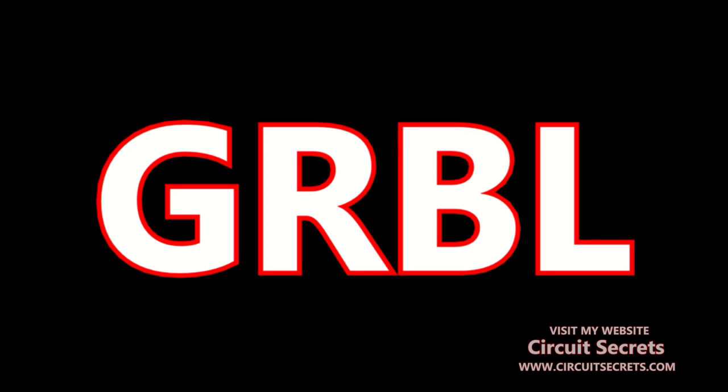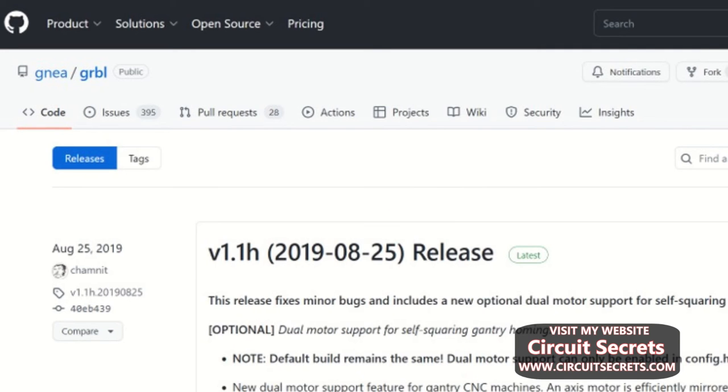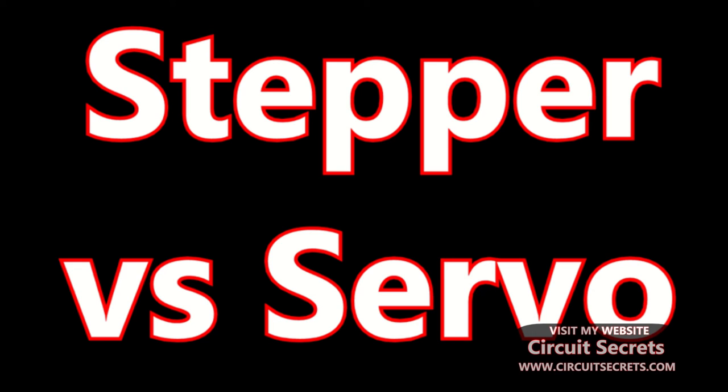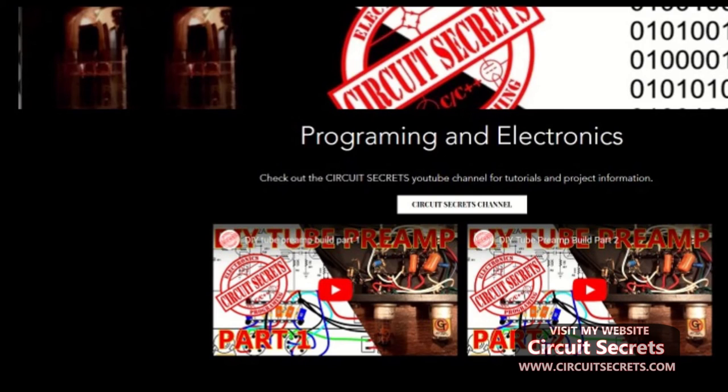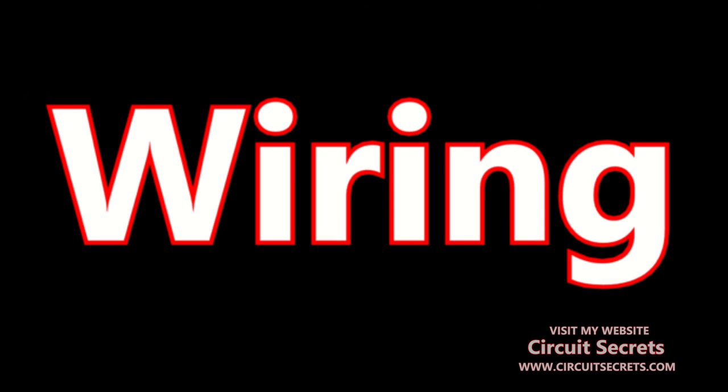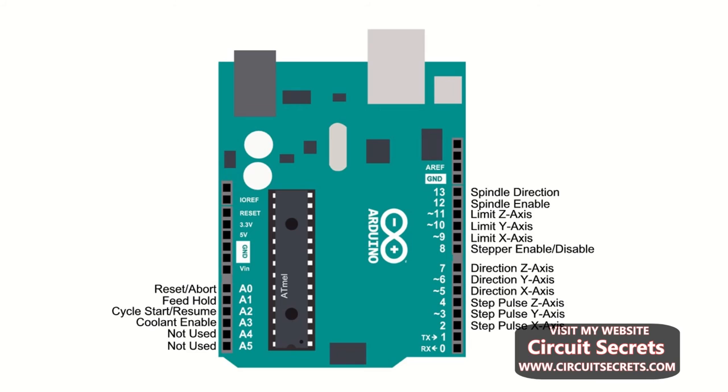On my rig I used an external homemade serial port adapter and an Arduino on a perf board, as I planned on adding another interpreter in line to take extra commands to control other hardware and relay standard G-code commands to the Grbl board. In most cases the Grbl board is just a normal Arduino connected to the PC through USB. If you're going to experiment with my DC servo motor control system, you can download the files from my website circuitsecrets.com — link in the description. The sketch installs on the Arduino boards the same as any sketch.